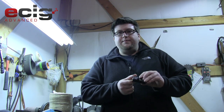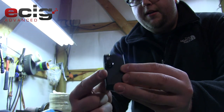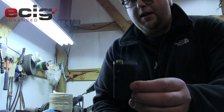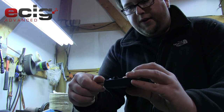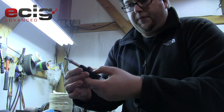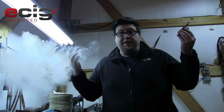That was pretty much it - it seems like a lot of work but it's really not. The hardest part really was drilling everything correctly. I did drill a little too close but that's okay. The LED and the button are up there - you can see the connector sticking out a little bit but we're going to superglue everything in. Let's see if the voltage is going to the atomizer. I pop the back on and this is essentially what it's going to look like when you're finished. I can hear a little crackle when I press the button - it's vaping great!